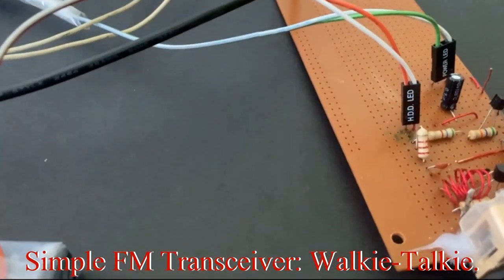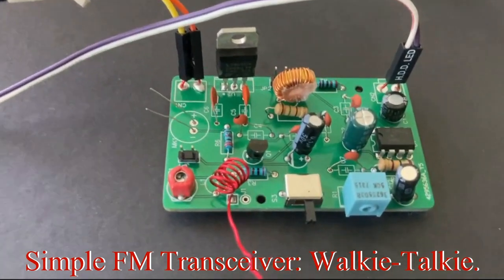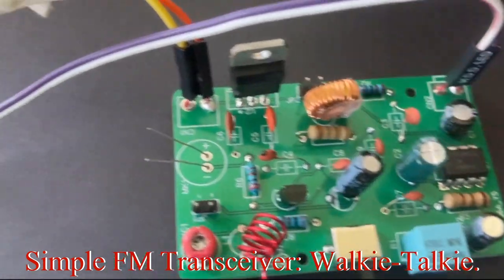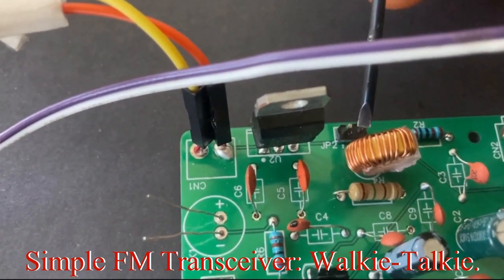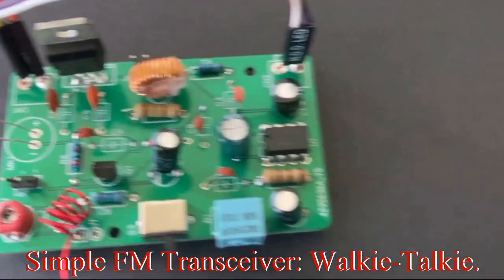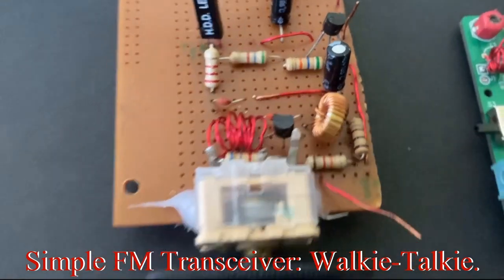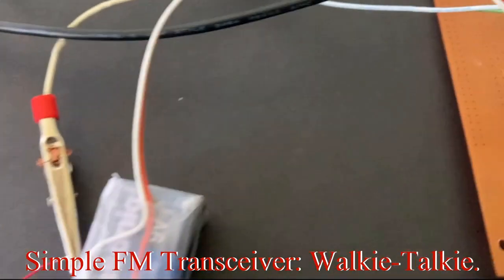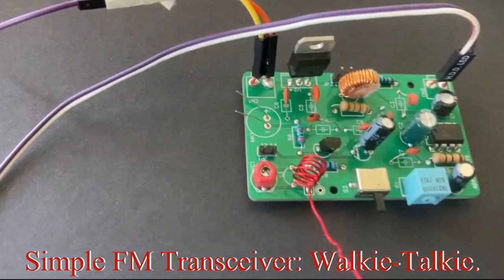I'll show you now how to build this circuit using the same components for a transmitter and receiver. There is a jumper wire in the receive section — we can jump this connection to improve things. I'd prefer you use this receiver's circuit diagram when you replicate this, because this receiver also functions as a transmitter. Include the extra transistor for preamplification, as this receiver performs better.